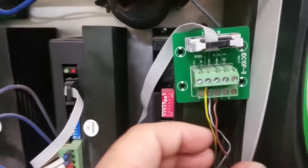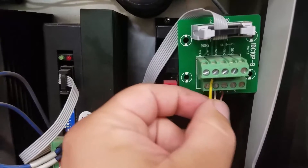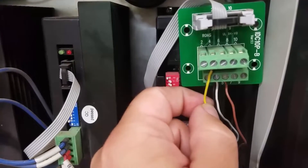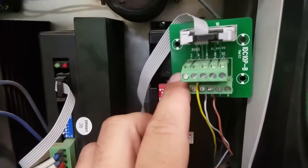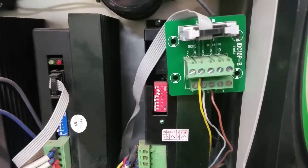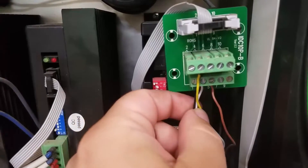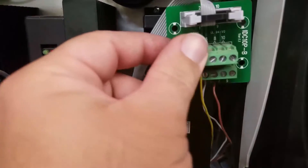What does that translate to on our blue data cable? The blue data cable has 8 or 10 wires. The first ones are step and direction. Yellow is negative step - yellow goes to port 4 on your breakout board. Brown is negative direction - goes to port 5. Black and white are your positives; they're sent to a common 5-volt source on port 3. This is all spelled out in your Tormach wiring diagram - this is for a 770 Series 3. Tormach does things backwards from everyone else: the step and direction signals come on the negative side of the wire - that's yellow and brown - while black and white are wired to a common 5-volt. Make sure you get that right.